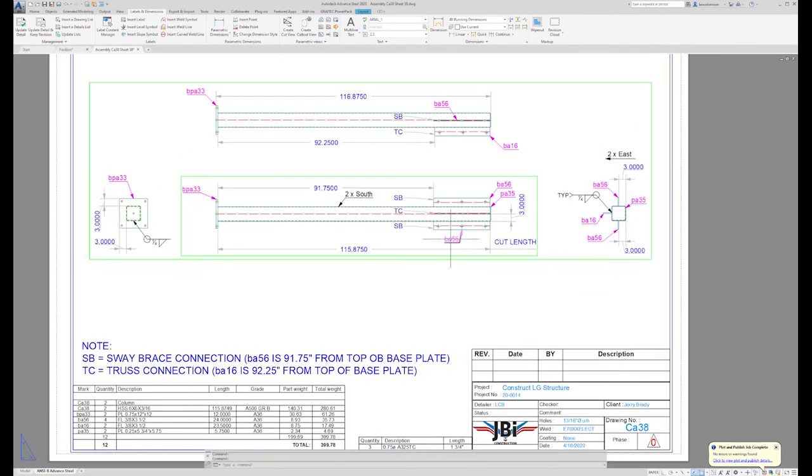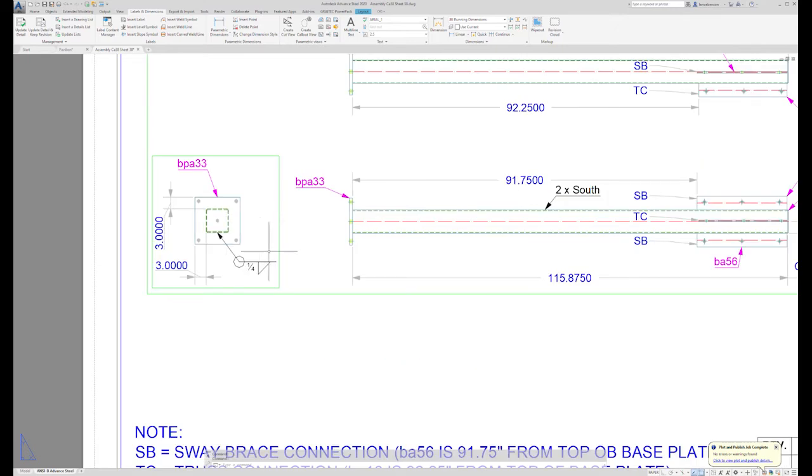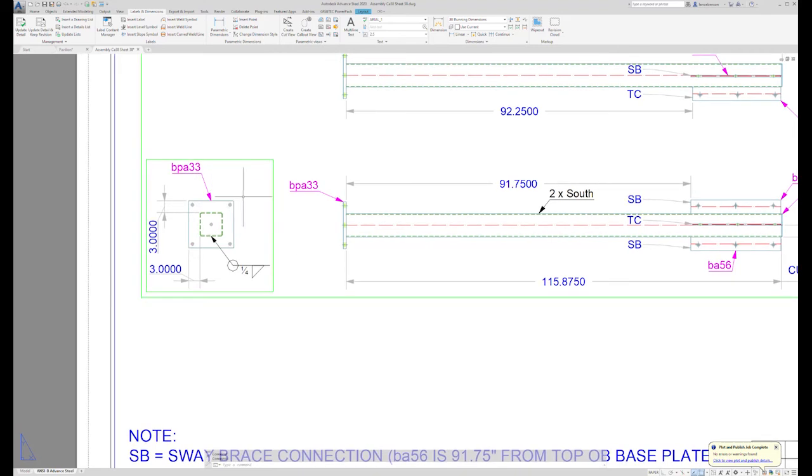Okay, going backwards a little bit, when a fabricator gets a drawing of an assembly, the first thing they should do is inventory all their parts. Make sure they have the right quantity of parts, that all the parts are cut to the right length, holes are in the right location, etc. Let's say they were going to look at this base plate. They don't need the dimensions for the holes on this page, because this is an assembly drawing. They need to check their hole layout and so forth on the single part drawing.